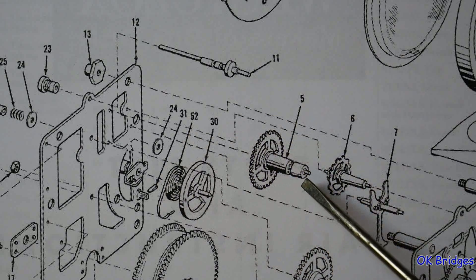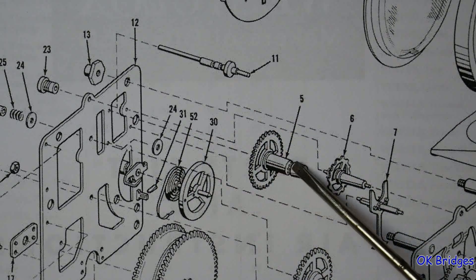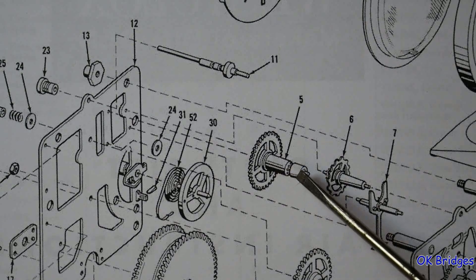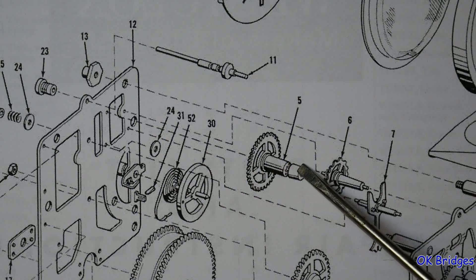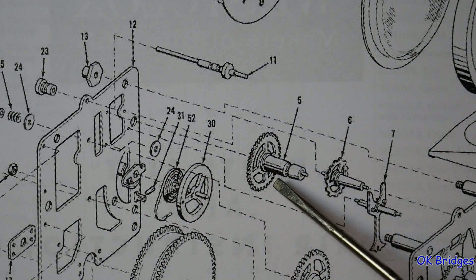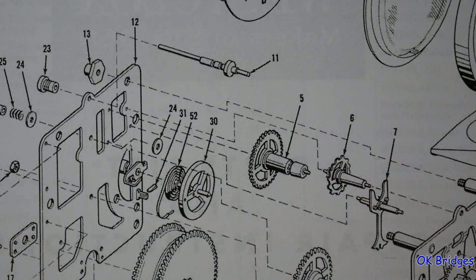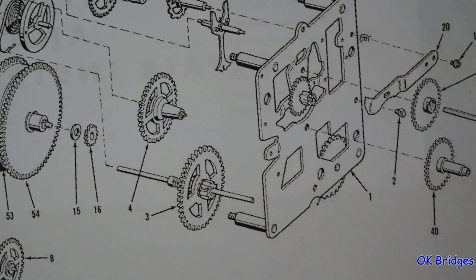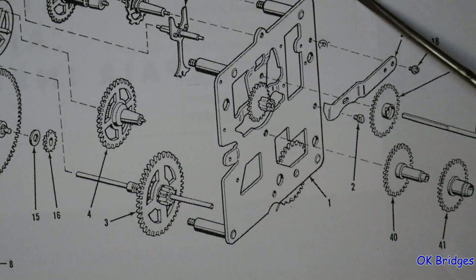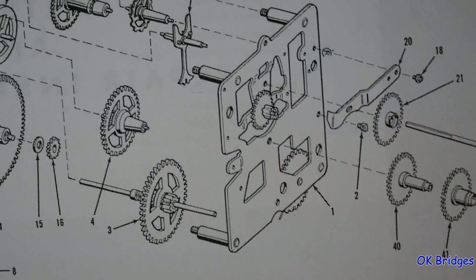The other interesting item is the fourth wheel with a shroud on the end of the lantern pinion. All the ones I've ever seen have had what I call cantilevered or half lantern pinions, where the pins project from the arbor but there is no hub on the other end to support the pinions. So I'd be very interested to see a movement constructed like this.